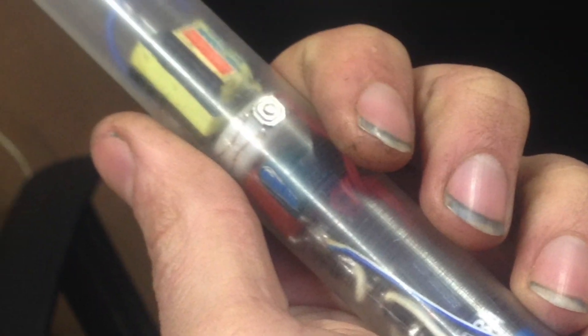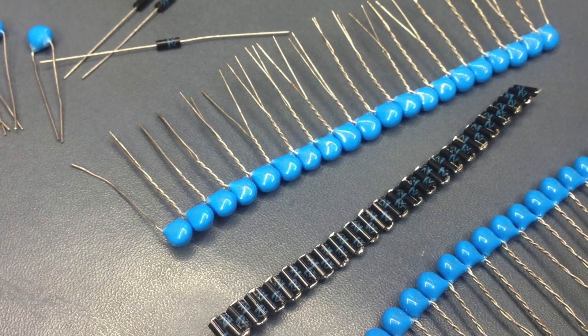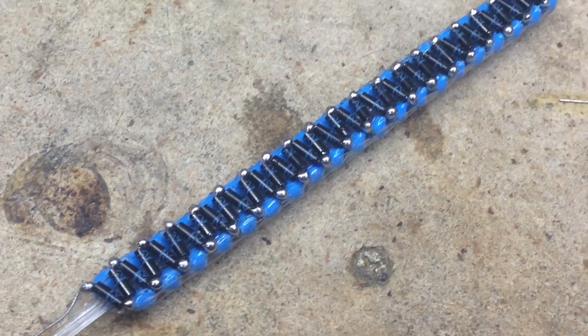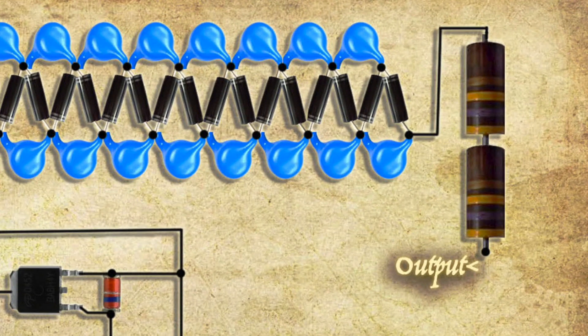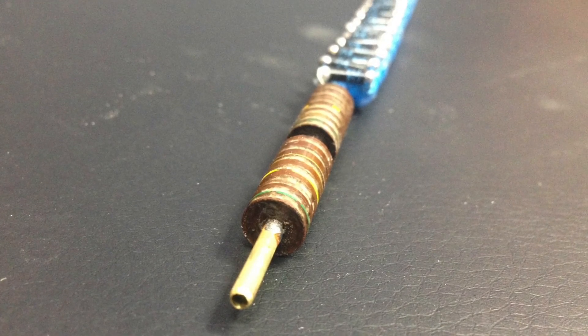You won't find Phoenix Feather or Dragon Heartstring at the core of this wand. Instead, a chain of diodes and capacitors line its core. Each capacitor is 100 picofarads at 8 kV and all the diodes are 8 kV at 5 milliamps. All the diodes and capacitors are soldered together into an extremely compact assembly. The last thing to note are these two 470k ohm 2-watt resistors in series, which reduce the instantaneous output current of the multiplier to protect the components and the human operator.